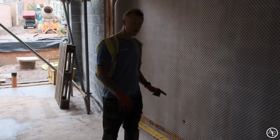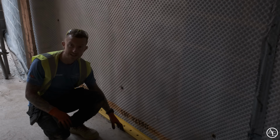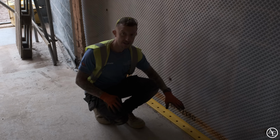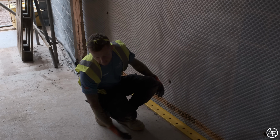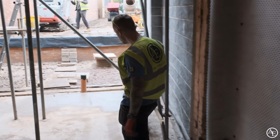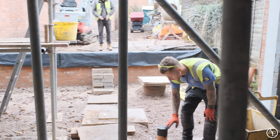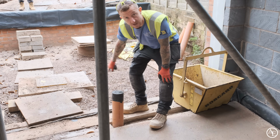What I will show you is our little tray system. If you remember from a previous video, you'll see why we did our little insulation detail to create our little recess around the edges. So this little tray here basically carries away any groundwater that comes into the property. It comes down the back of the tanking or underneath the floor tanking and will find its way into this tray. It will then go outside, work its way around to this point here, which will obviously be cut off, and then the drain will go out through that and out into our pump outside.